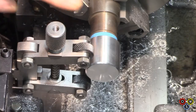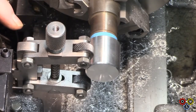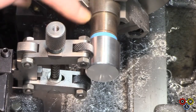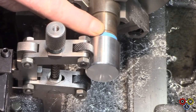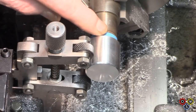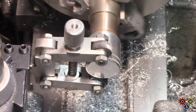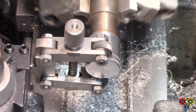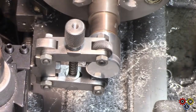Now, as a slight afterthought, decided a bit of knurl would be useful at the top of the cap. So set up the homemade knurler, and the cap is pressed onto a piece of spare material that was turned down slightly and wrapped in painter's tape, and pushed it on with some difficulty so it should hold. And then using the spindle handle, gradually add some knurl. It's basically only the width of the rollers, but that was thought to be probably adequate anyway.